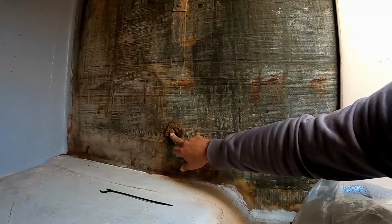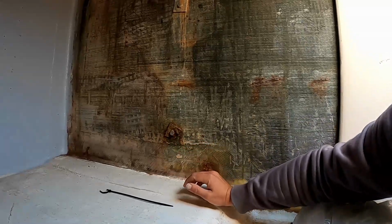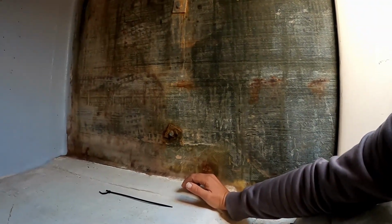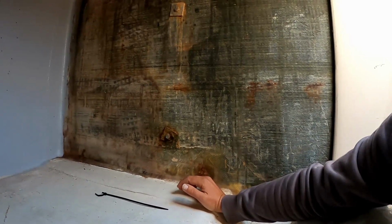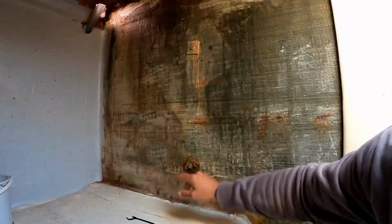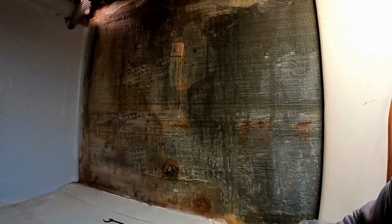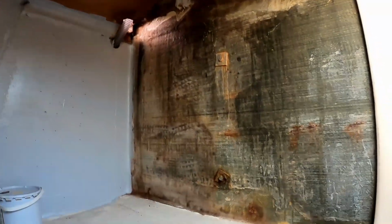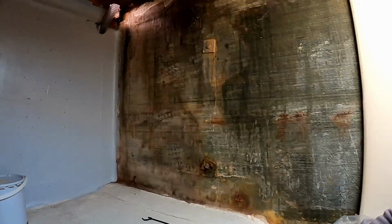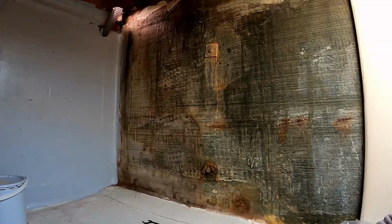Absolute worst case scenario is we end up with a small amount of pitting on the surface, and it looks more like a crevice corrosion than it does an electrolysis corrosion. But we're taking off, we're going to paint the bulkheads. Basically, I'm getting the really shitty aluminium out. And we aren't going to put lining back there, so we'll be able to keep an eye on it too. I've never had issues with stainless steel bolts going through carbon boats, other than rust stains. Aluminium, on the other hand, just gets eaten up like our kids eat bread.